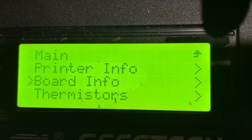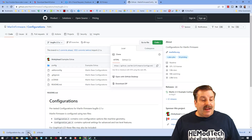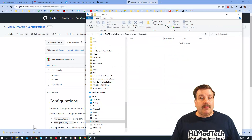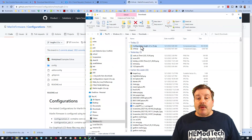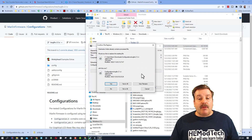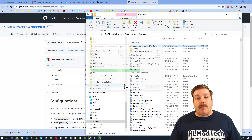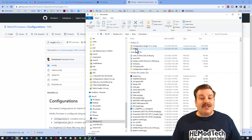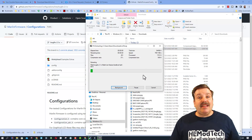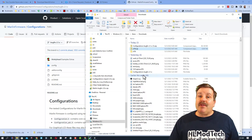Now I'm ready to roll. With that done, I'm gonna open up that configurations zip by clicking show in folder, right-click, use 7-Zip, and extract here. They make their own folder. I'll say yes to all for replace. Let's use 7-Zip to extract the Marlin zip as well — I'm gonna choose the special A10T folder so that way I keep my configuration separate for each printer I flash.